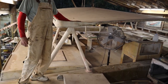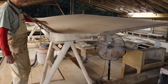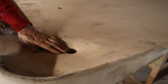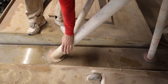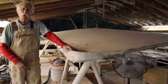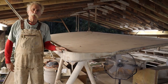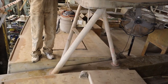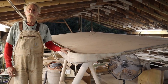Here we are at the hardtop. We've made several changes up here as well. We've added the gutter grab rails on the sides and set it up so that they all drain down into these front legs. We'll have a spigot down here so that we can drain the water out. It also serves so that all the water dripping off the hardtop just from morning dew won't make a mess on the deck all the time. We can put a hose on that spigot and run it overboard where it'll just drip harmlessly, or we can collect it when we want to.